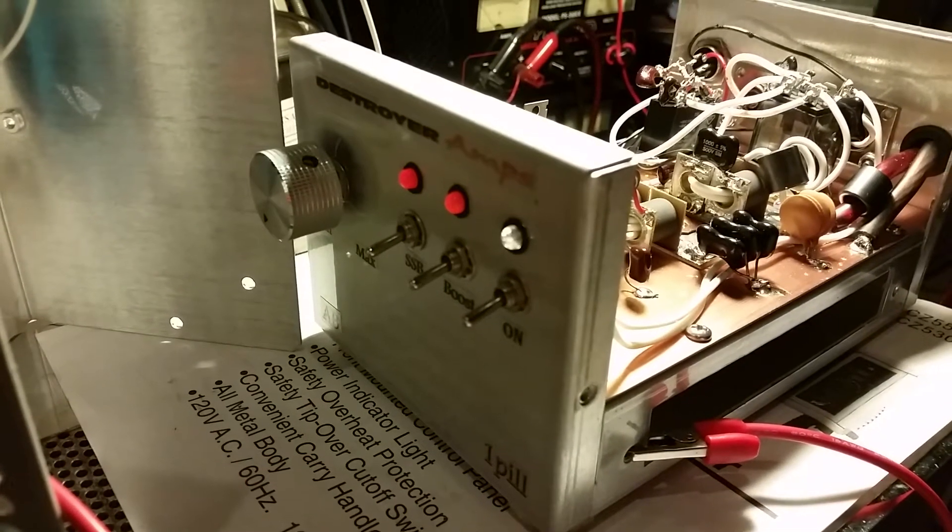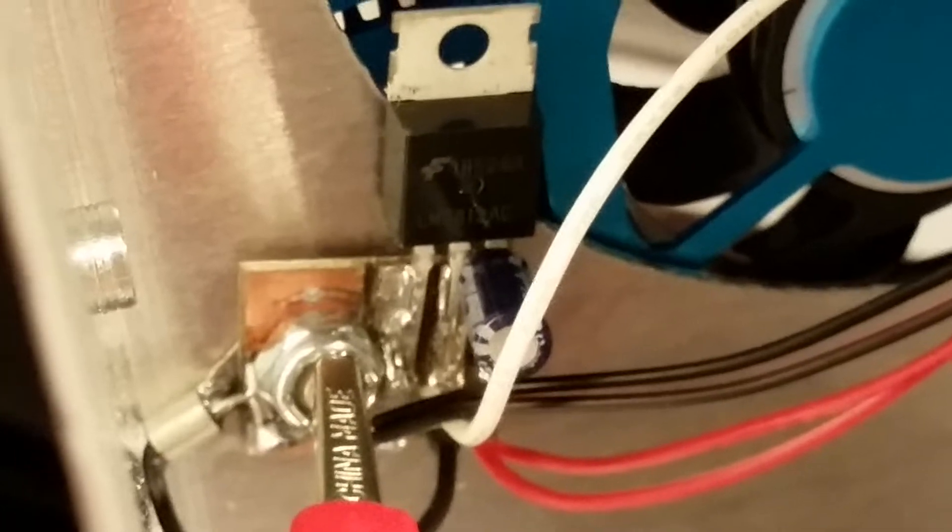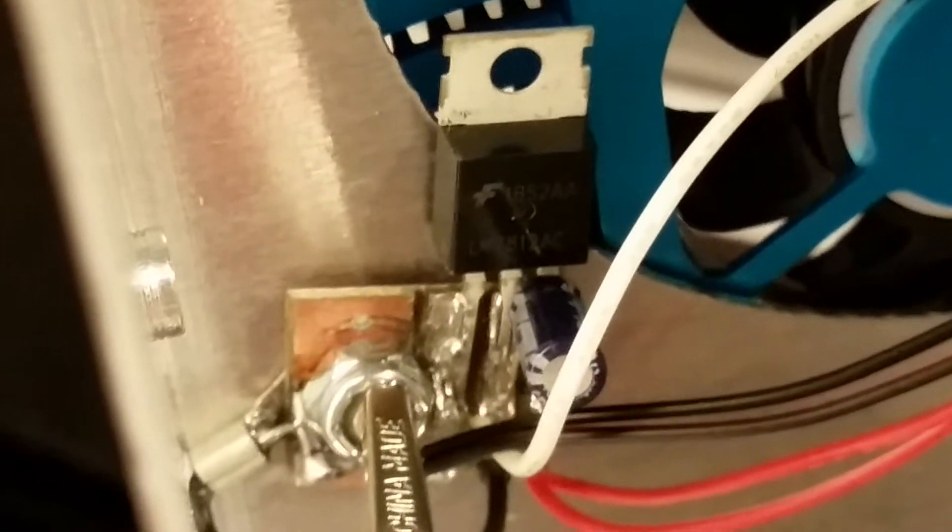I figured out what's causing this and what will make it quit. If you look at this circuit, you'll see there's an electrolytic on the output of the regulator — that's there to filter what's coming out of the regulator, to keep noise down and to keep the regulator from self-oscillating like it's doing right now. But there's nothing on the input.